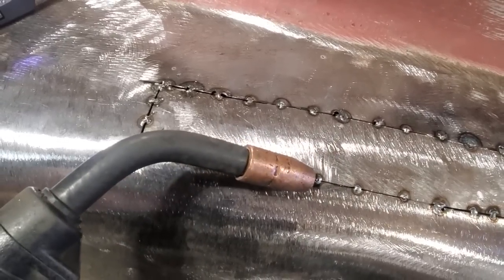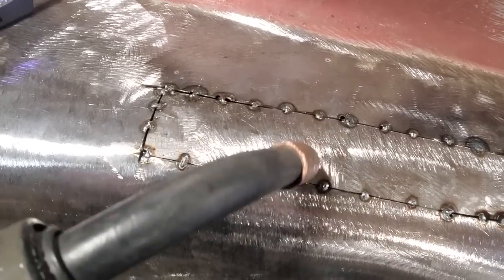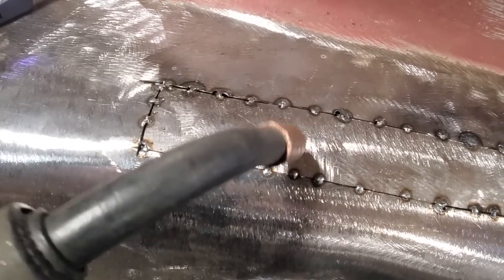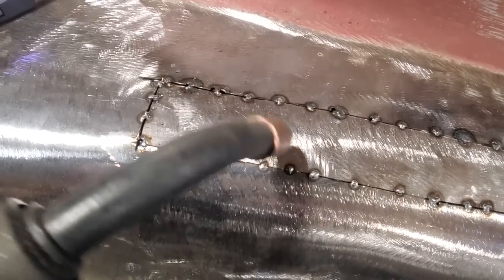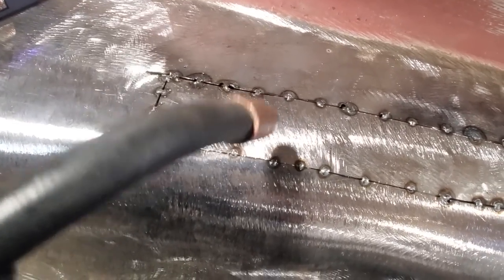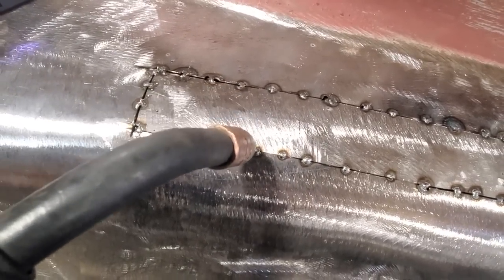This way here, you're going to get a flash. This way here, with a pair of safety glasses on, you shouldn't get a flash, because you're not looking directly at the arc itself. All you're getting is bright light through it. You're still getting UV rays, all that type of stuff. Yes, I understand all that, right? I've been at this a long time to know the difference in it.